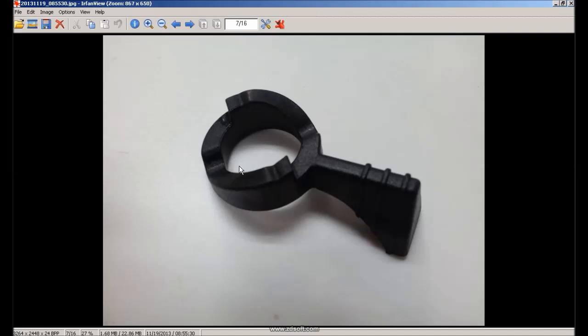In SolidWorks, for this kind of geometry, we cannot do a cut extrude on the cylinder, because the surface of the cylinder is curved. If we put a flat plane here and cut extrude, it would be a problem for us to do this groove. The curvature upward is quite difficult, because the curvature flows in this direction, but for this curvature it flows in that direction. One way, I think the best way in SolidWorks to do this, is to use wrap. There's a Wrap command in SolidWorks.